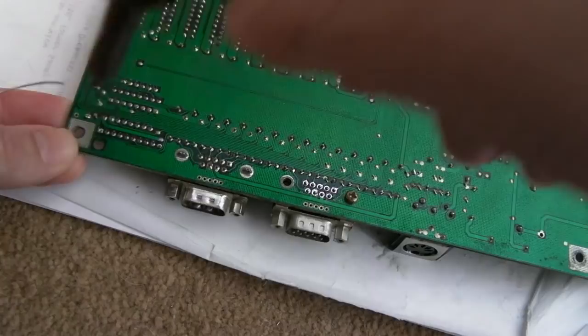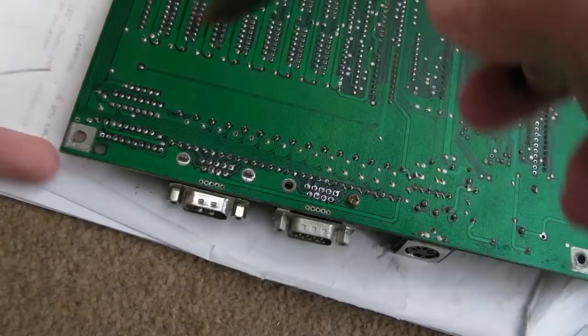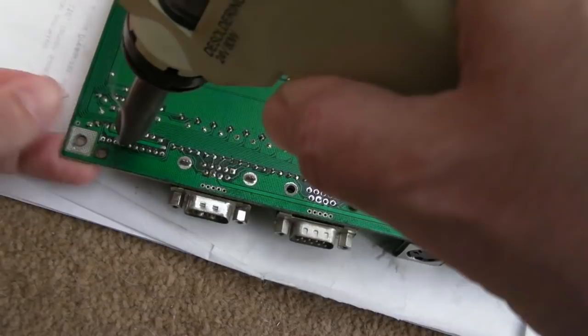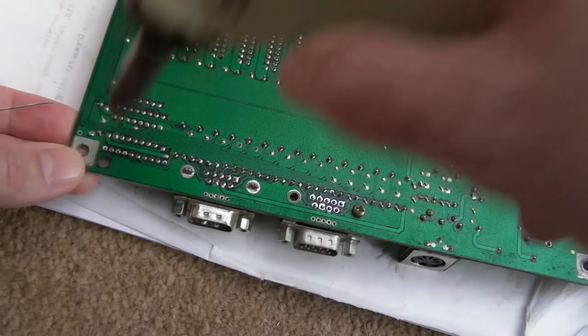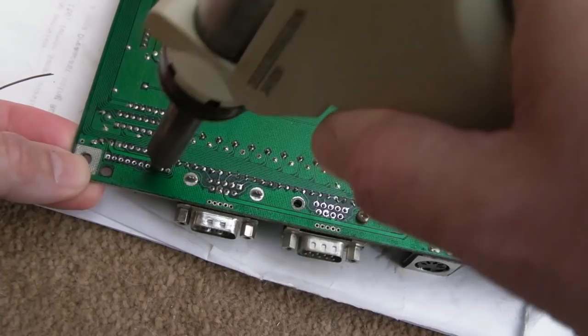I'm not sure that's removing as much solder as I would like. I have to go over this a few times, or give it a little bit longer. The station's set pretty high as well, about 430. But you tend to find, certainly what I found anyway, on these 2000 boards, you need something like this with temperature control and more power, more ability to dump heat into the board in terms of wattage. I think it's also important to point out these pins here were not particularly adversely affected by corrosion, so it could be some level of corrosion's got on them.